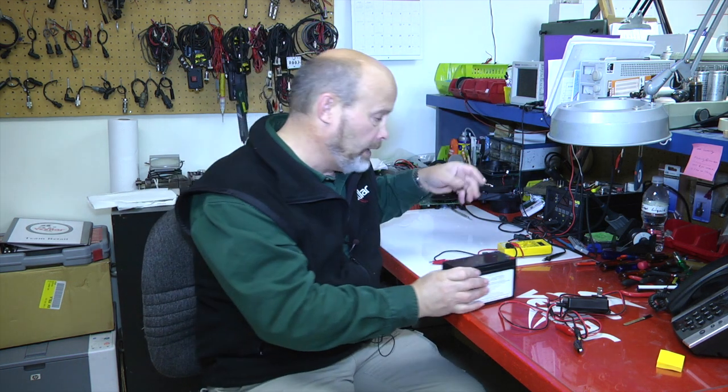Now, a 7-amp-hour battery works great, but you need to recharge it all the time. And if you do that, your battery will last a long time. A battery meter will help, but remember, when it says 12 volts on here or 6 volts on here, your system will fail. So charge your battery after every use. And before you call us at Vexilar, make sure you've got your battery on charge at least overnight to see if it is indeed the Vexilar.